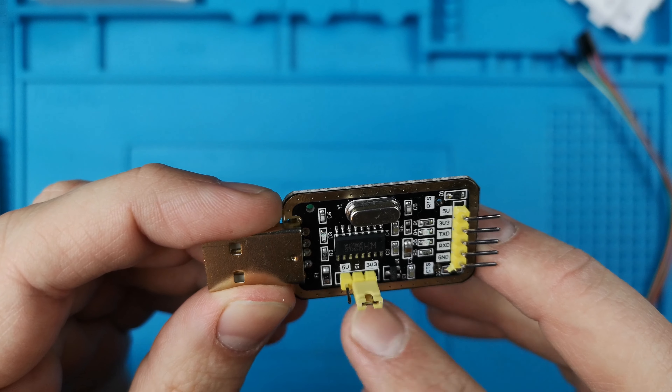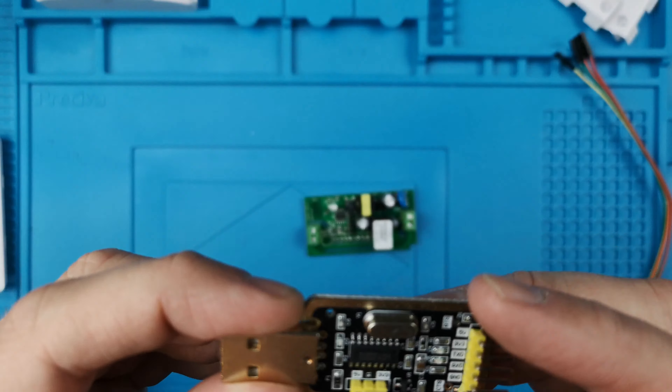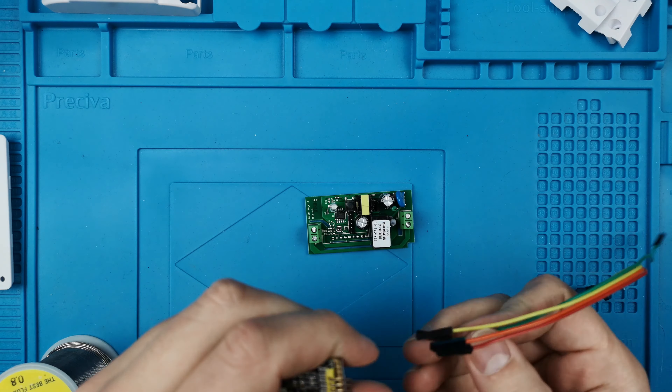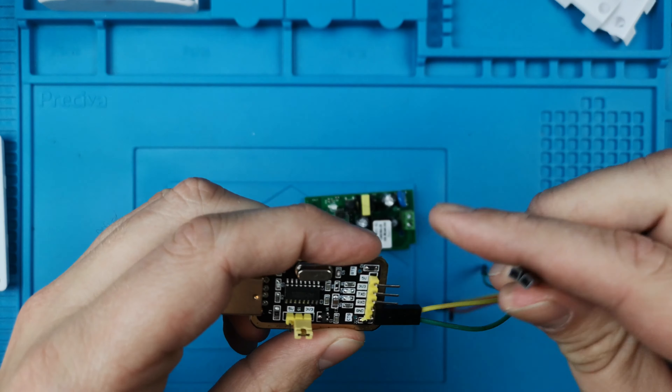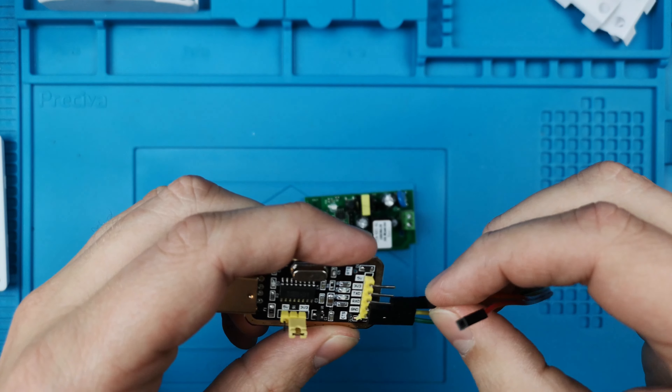What is great about this device is that the switch is wired to GPIO 0, which means that when we flash it we just need to press a button — we don't have to worry about using another jumper to ground.